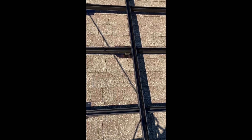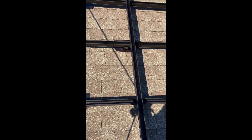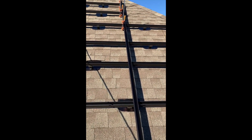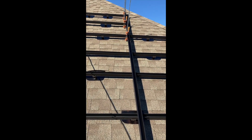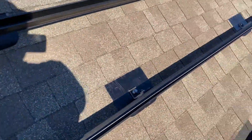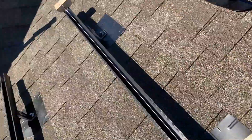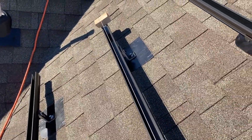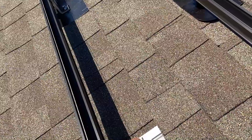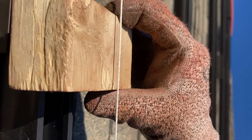Once I got all the rails in place, I used a rail as my straight edge so the ends of the rows could be the same height. I tightened those mounts down. After that, I used a string line to straighten the rest of the rail. After setting your edges, you get the middle lined up — use a two-by-four, sit it on one end then the other, pull the string nice and tight. As you go along, use another cut two-by-four. If you see a gap, the rail is too low.